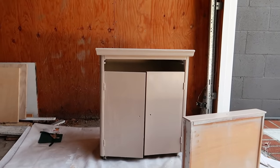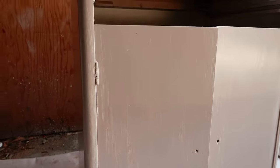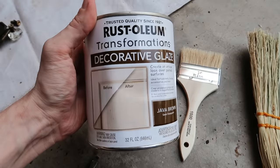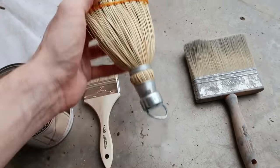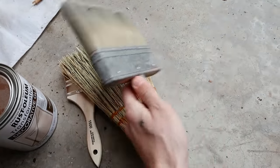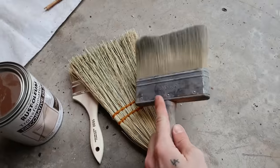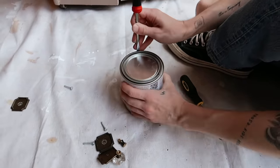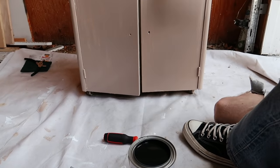Our coat of paint is fully dry — this is our Rugged Tan color. I applied just one coat because I actually like seeing the brush lines and primer peeking through underneath; it kind of adds highlights to the wood texture we're going to create. Now for the fun part: we're using the Rust-Oleum Transformations Decorative Glaze in Java Brown from Home Depot. I also have coarser hair brushes, a handheld broom, and the brush I used to paint Marie's entire bedroom with Portola lime wash. The glaze has a thinner consistency than paint but thicker than a stain — somewhere in the middle.